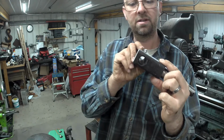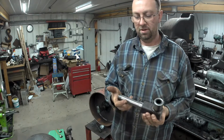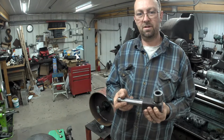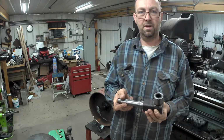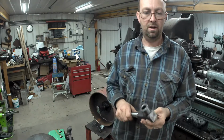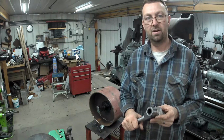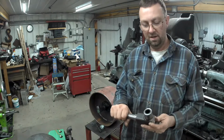And the bushings were Nylotron GSM. I've been using this stuff for quite a few years. We've been replacing a lot of bushings for some of our customers, replacing bronze with Nylotron GSM, and the wear characteristics have been just incredible. I have a good friend who actually makes a lot of gears out of Nylotron, and they hold up really well. So it's a good product, good material.